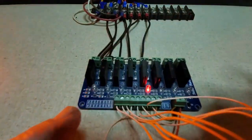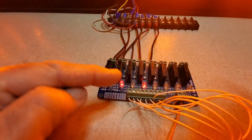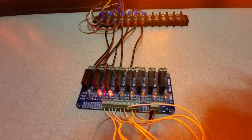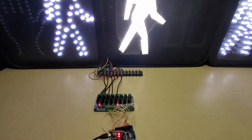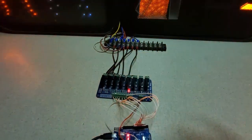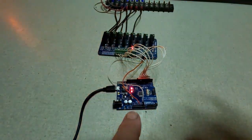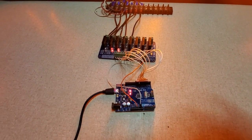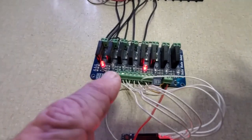You'll also notice you don't hear any clicking — that's because these are solid-state relays with no mechanical parts. You can get an array of eight on eBay for about eight dollars. It makes everything run nice and quiet, which is how real traffic signals work — they use a load switch, which is essentially the same thing, typically with three of these inside. It's also safer for your Arduino since you don't get voltage kickback blowing out your ports. You can see ports 2, 3, 4, 5, and 6 connected right there.